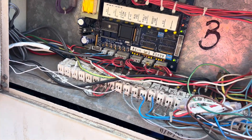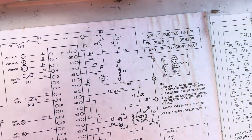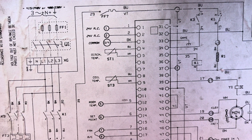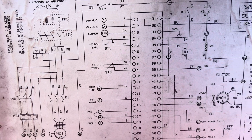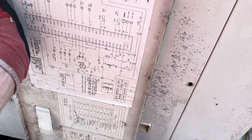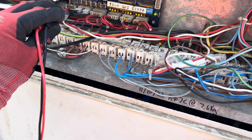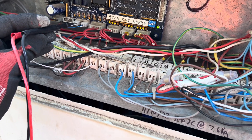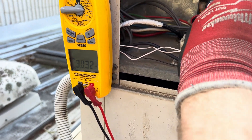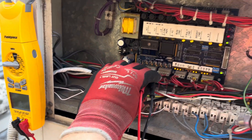Since this one is saying sensor open circuit, I'll check it out before I get my gauges. It appears to only have two sensors down here — coming out of terminals four, five, eight and nine. Four, five are discharge; eight and nine are coils. That appears to be all it does.